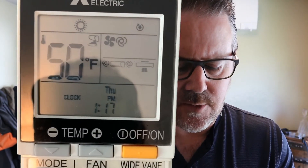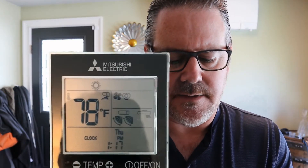Smart Set: let's say you leave a room unoccupied — hit the Smart Set button and it'll hold at 50 degrees. This is perfect for people who leave their house for the winter and just want to keep the pipes from freezing. When they get back, they hit Smart Set again and it jumps right back up to whatever temperature they had set, whether 70 or 72. So right now Smart Set would go to 50 degrees — you can see that on the display — simple as that.